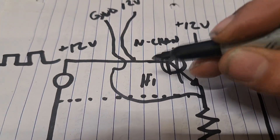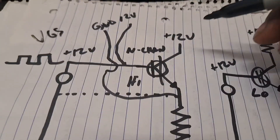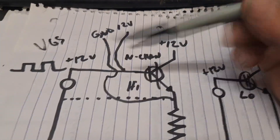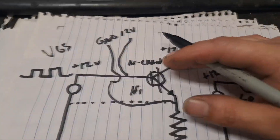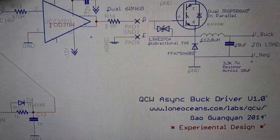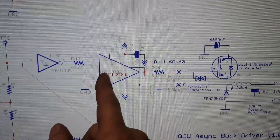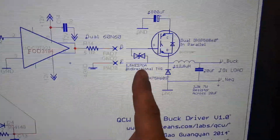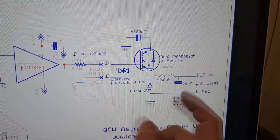As long as you can supply the gate and source of your FET with the proper VGS, that's what matters for switching. An opto-isolator or something is obviously recommended, but I did my first testing without any of that. Looking at an actual legitimate circuit — a loneoceans.com driver — this is an async buck driver marked experimental. You can see there's really nothing magical: he's got a low-side gate driver, high-side switch, TVS diode protection across the gate, and a 5-ohm gate resistor.